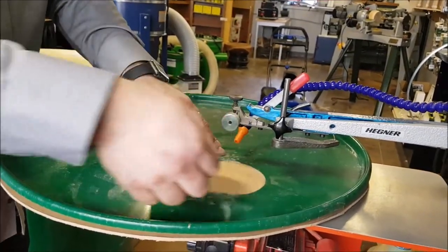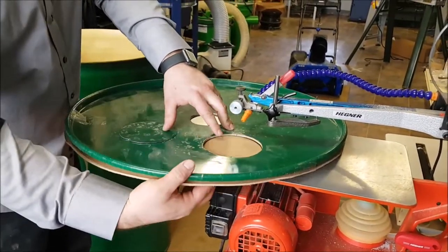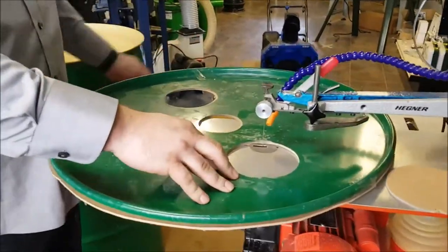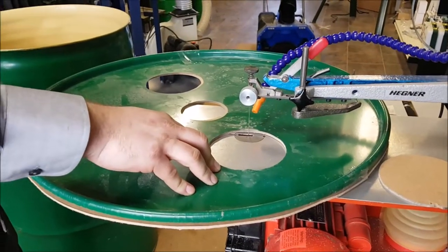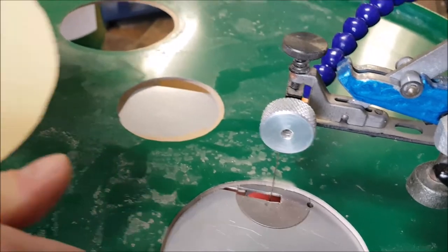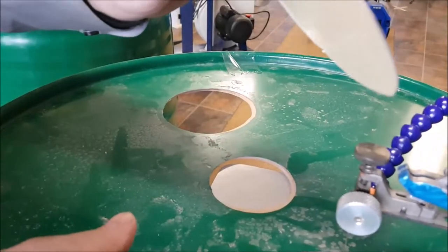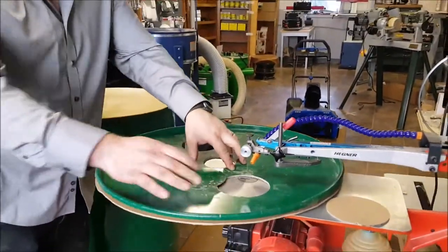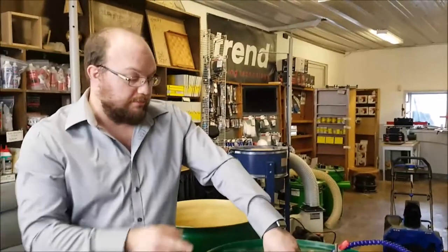Okay, so that was my last cut. I will say with these metal cutting blades they are very brittle, so make sure you don't put any side pressure on them at all — just go slow and they'll work well for you. Because they're hardened, that makes them a little bit less forgiving than a standard scroll saw blade. I got my cuts done and the beautiful thing is with that backer board, it's very clean on the bottom. That's just a little under a sixteenth of an inch — mild steel. So yeah, if you are cutting steel, the scroll saw is definitely something you can do. Just make sure you have the right blade and patience. If anybody has questions you can email me at info@stockroomsupply.com or just comment on the video. If you want future videos make sure you subscribe and hit the little bell button — thank you!